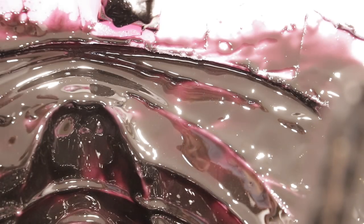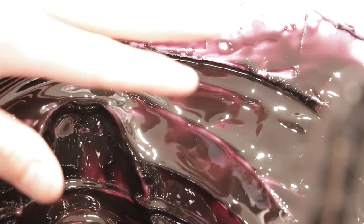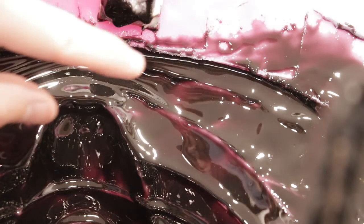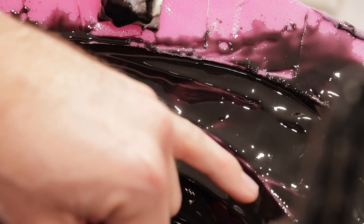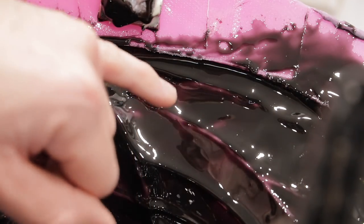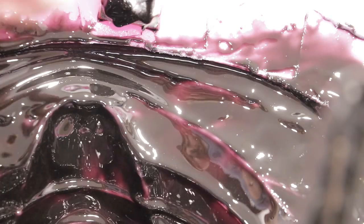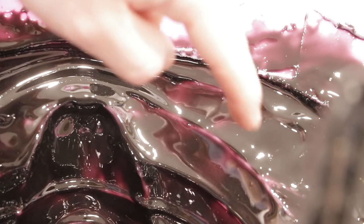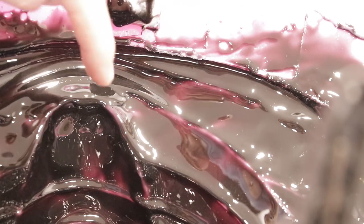The first coat has pretty much dried and is starting to get very tacky. I think we're going to do three more slush coats. One thing to really look out for with flexible urethane casting is any high points — even soft high points. Anything with a sharp edge you've really got to build up, keep working it whilst it's about to gel. Over this area it's more uniform, but here we do need to do a bit more work.